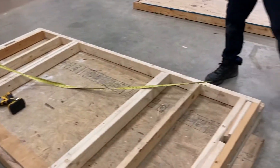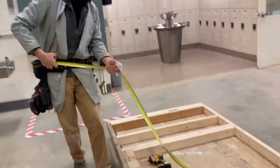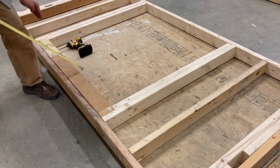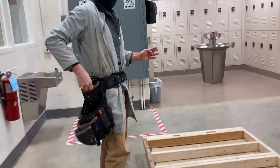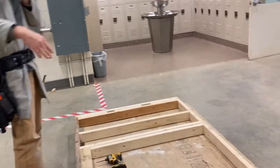That makes sure that this wall isn't like a parallelogram — it's perfectly a rectangle. Now that they have it square, they took a screw and temporarily tacked the wall so that while they're putting their wall sheathing on, the wall isn't racking around. They checked it for square, everything is ready, and they can start installing their wall sheathing now.